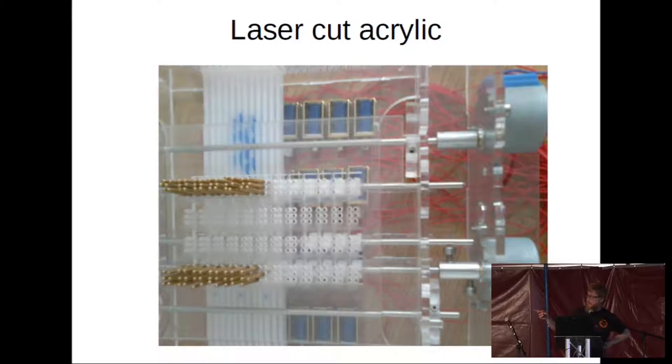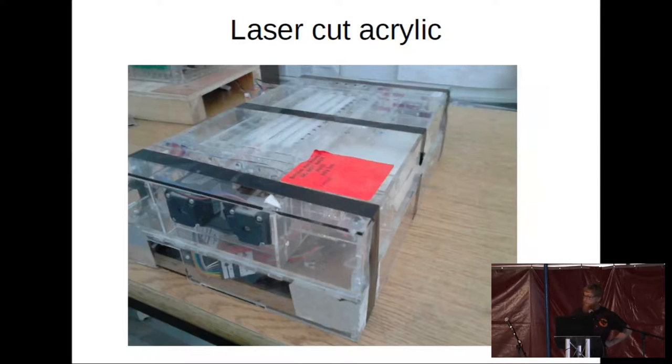This particular machine uses brass pins and solenoids. The rows up the side were controlled by stepper motors, and then the columns were controlled by solenoid actuation. This wasn't anywhere near the figures I mentioned earlier for number of actuators, but it was still quite low. This is another prototype we made — with much bigger stepper motors, more like the ones you'd find on RepRap 3D printers, only slightly bigger.